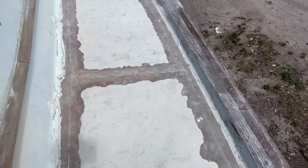It's been a very, very dusty day trying to get this deck repair sanded down so that we can put a layer of fiberglass over the joints and sand that down. But at least we can get it sealed up before any of this weather rolls in in a more threatening way. I'm gonna use some acetone to clean up the joint there, then lay down some glass and some resin, bond the joints, then sand it all down with fairing compound and level it out. Probably about halfway done with this little project.